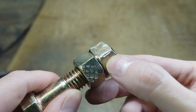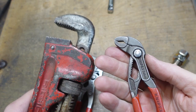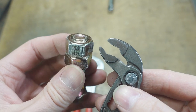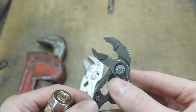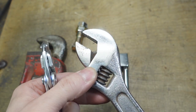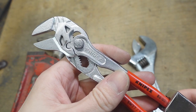I've done multiple tests with these 125 Cobras as well as these plier wrenches. When you really put torque on these Cobras, I feel like they're more like a standard pipe wrench — the harder you pull on them, the tighter they seem to grip, and I never felt like they were ready to slip. Ultimately the nut will fail, but the tool itself has an infinite amount of grip. When I tested the plier wrench, it seemed to react more like a standard open-end wrench, because the more torque you put on them, at some point it seems like they start to round the bolt. But at the point they do that, you're already well beyond what they were designed for.